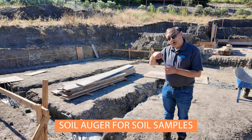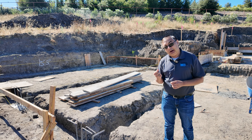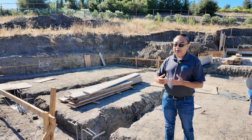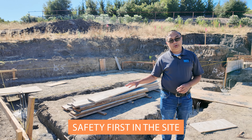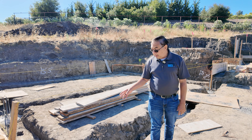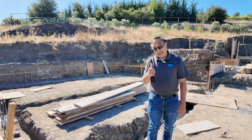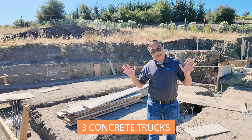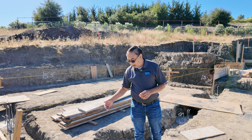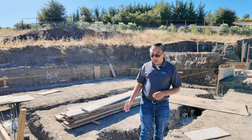As we dig each of these piers using an auger like a corkscrew, the soils engineer tells us when to stop digging. They literally hold the soil in their hand and establish whether we've hit base rock or whether we're still going through native soil. These holes are pretty deep — if somebody falls in, it's a big accident, so we cover them with plywood. We've poured 43 cubic yards of concrete so far in the piers — that's three concrete trucks — all done in about half a day.